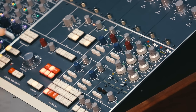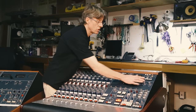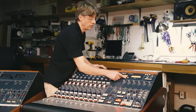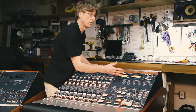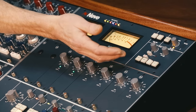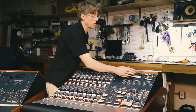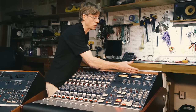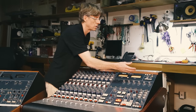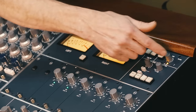We also have an insertion which can be pre or post fader, a main mix fader, and a parallel blending system. We have a set of 1272s for the bus outputs, two large VU meters which can be desensitized by minus 10 dB for when mixes are very hot. We have an oscillator and a pink noise generator that can be sent to the direct outputs, the main mix, and the loudspeakers to verify tone, levels, and SPL. Lastly, we have a solo indicator, an RTB input, and a talkback microphone.